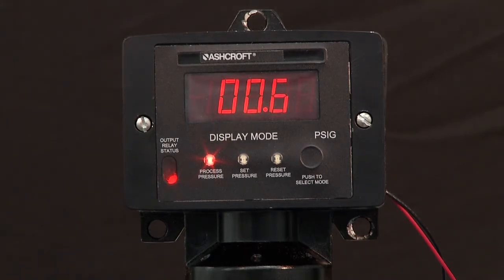I'm going to bring the pressure up, and we're going to slow down when we get near 80 where we set it to. It turns green at 80. Then we're going to drop it all the way down to just before 20, because it should stay on until 20. And it turns off exactly at 20. So that switch is now set between 80 and 20. It's important to always set the higher pressure on the upper potentiometer and the lower pressure on the lower potentiometer.